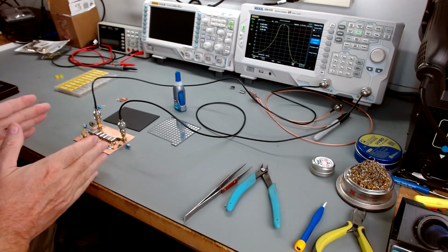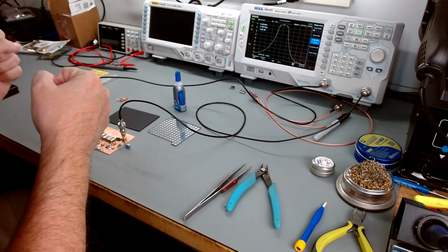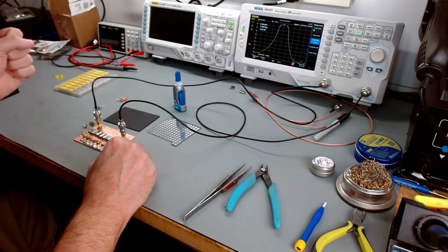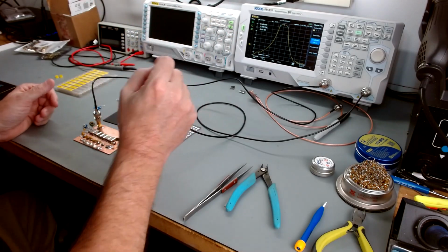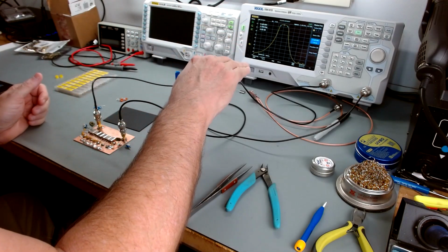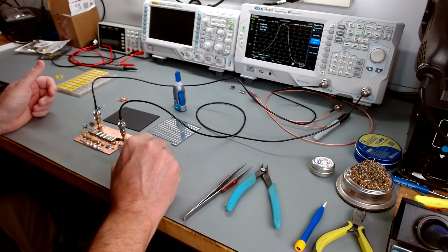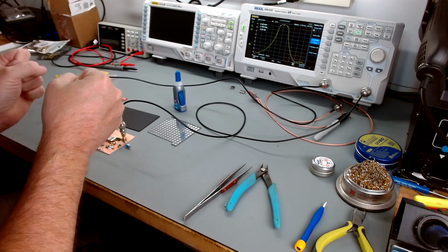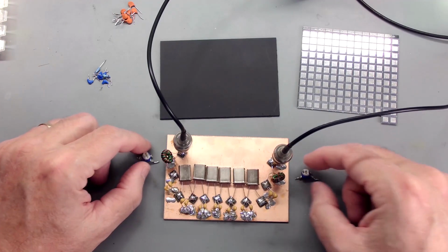Now the thing is, you don't want to have a lot of resistance on one and no resistance on the other. So I started out with them both at 0 ohms, and I would turn 1/8 of a turn on this one and 1/8 of a turn on that one and see what I got. And then I'd go 1/4 and then 1/4, keep them matched and see, is it better, is it worse? I played with it a little until I got a little bit of improvement. And then I couldn't get any more. Now while I'm doing this, the losses are going up dramatically. Don't worry about that. Obviously, we're putting resistance in the line, you're going to get losses. So anyway, I've got it to the least amount of resistance, the least amount of loss that gave me the best bandpass, least amount of ripple, just the way Charlie showed it.